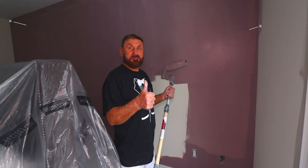And that's not even factoring whether the walls are dirty or clean, or if the finish has faded over time — there are just so many variables to consider. If you want a really consistent look, then just paint the whole room. And if that isn't an option, then avoid the tester, get a quart, and just paint corner-to-corner instead. I always find that's a better alternative than trying a touch-up in the middle of a wall and just having a little spot there.